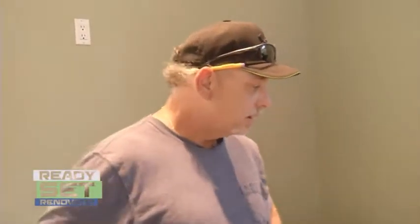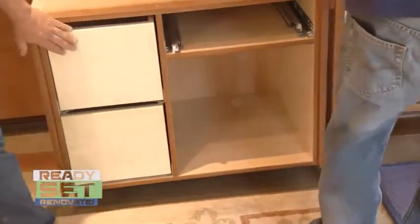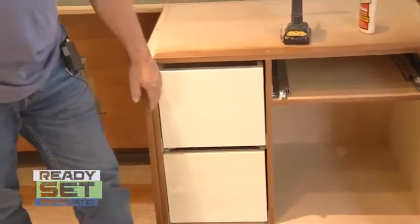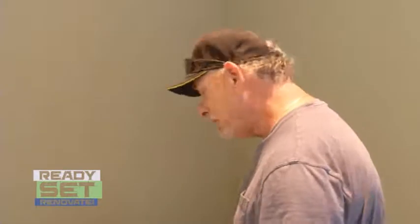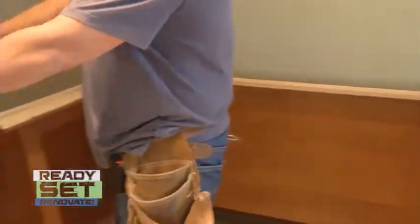What were your specific design challenges when you were kind of coming up with the concept? Well, he wanted a printer, which is going to be in this opening right here, yet he wanted his file drawer right next to him. Okay. So we made a 15-inch file drawer so his reach wasn't as far to go to the printer. Now, with that being said, he also wanted to be able to have a knee drawer here and pivot and swing to the next knee drawer. Okay. Right? That way he can have access for a wide range of area on the desktop.